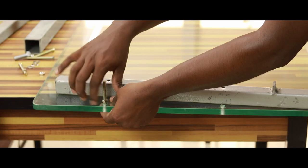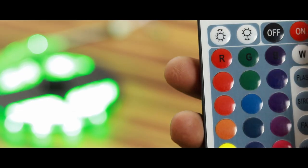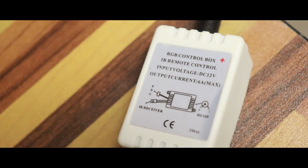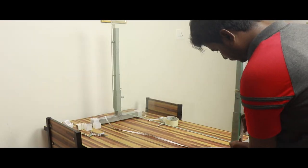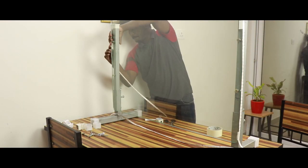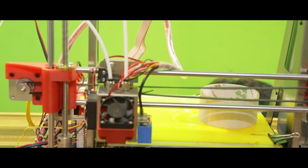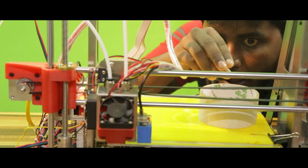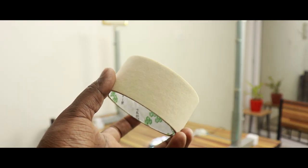The glass was separated from making direct contact with the frame using a bolt. I bought a 5-meter LED strip and I just used 2 meters of it. It comes with a power adapter and a remote as well. This is an RGB LED strip, so I used the remote to set it to white. After mounting the screws, I attached the LED strip at the top and sides of the glass. I used my 3D printer masking tape to fix the strip.